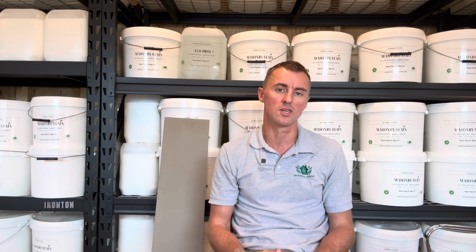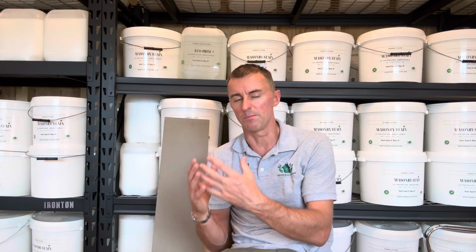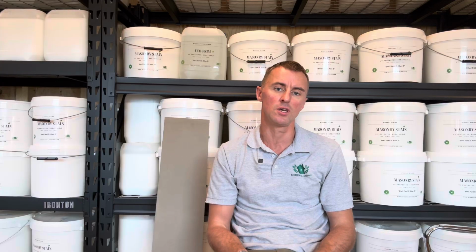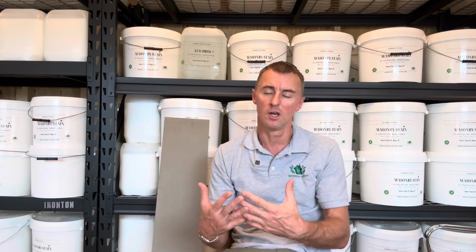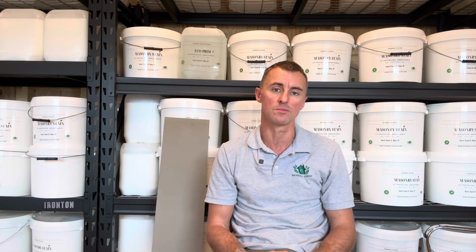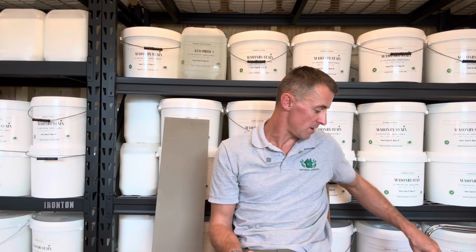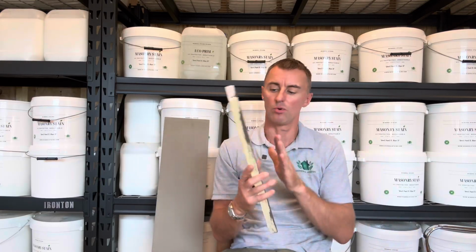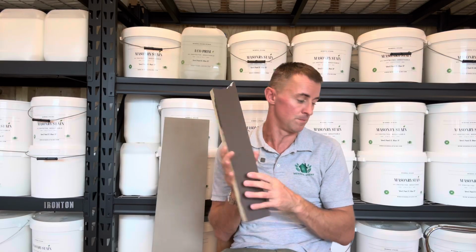But our message is to get the point across, and Loxon, the Benjamin Moore products, the PPG, they're not really intended for masonry. Yes, you could put it on, but the water vapor transmission is going to be minimally 5 to 6 times reduced of what the silicates are going to achieve. And lastly, when it comes to Hardie boards, it's also meaning the silicates are non-combustible.